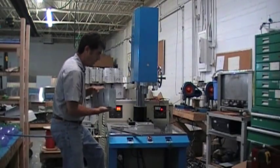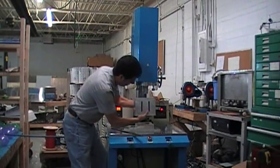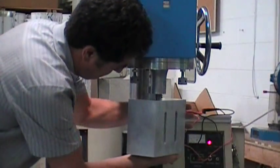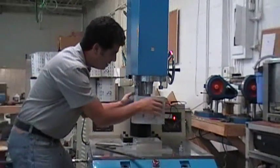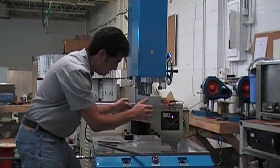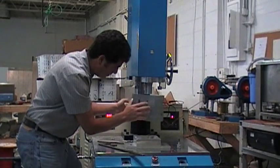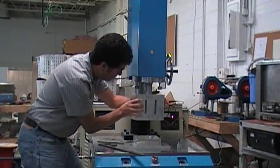This is how you can damage the converter if it goes in wrong — but I got it in right. If it's cross-threaded, you can damage the converter, which is a very expensive item. That's why it's better not to keep switching horns. It's better to have two machines tuned properly that run forever on the same part, rather than replacing the horns every day.